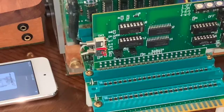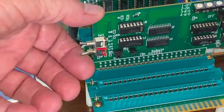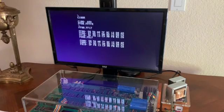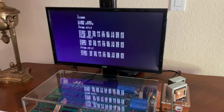We now switch the F block to FRAM read-write. We now reset and see that the Apple One monitor is working in the FRAM. We now read from FF00 to FF17 and from F800 to F817 and see that the monitor appears at FF00 but not F800.